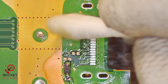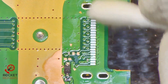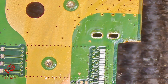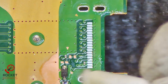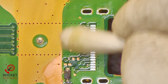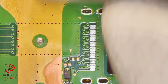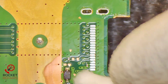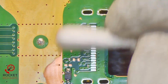There are so many different techniques to change out an HDMI port, by the way. My preferred method is using a solder sucker on the ground legs to clear those out. You can use a soldering iron with hot air, but just trying to clear the ground legs out with a soldering iron - unless you've got a top-of-the-range one - I don't think is necessarily doable. I failed doing it a bunch of times, which is why I opt to use just the hot air and the solder sucker. But someone else might have that routine down - I'd be interested to see.